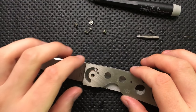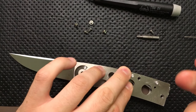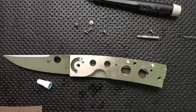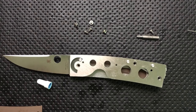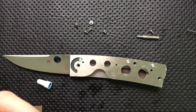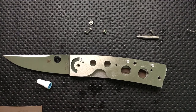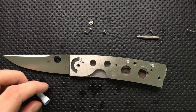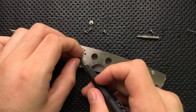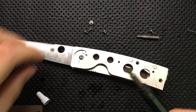What am I forgetting here? The stop pin is internal, so I don't need a separate stop pin. The backspacers are in place. There are no holes that seem unfilled that need to be filled. Those two pop in. I managed to catch my finger in it, but I will survive. Now I need to insert the three screws here, here, and here. I believe that was a T9. I see a hint of Loctite on this screw, so I'm going to give it a hint of Loctite in return. There we go, that's in. Leave it finger tight at the moment.